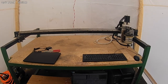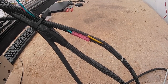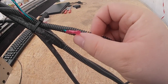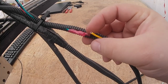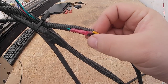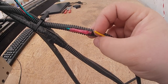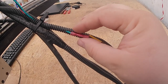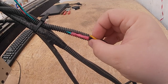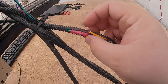I think I found one wire that is either broke or burned up. I'm going to change the wires and see what that does. Pretty sure I found my problem — I untaped this and I found a broke wire at one of my connections. This was supposed to be temporary anyway, so I'm going to fix it back. Eventually I'm going to put some better connections, something I can take apart, like aviation connectors or something like that.